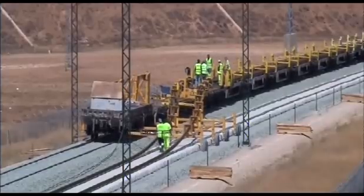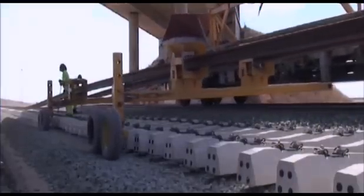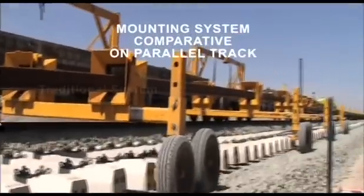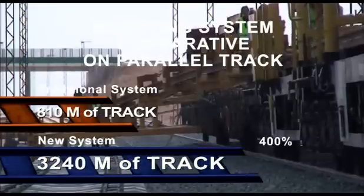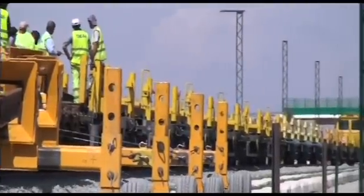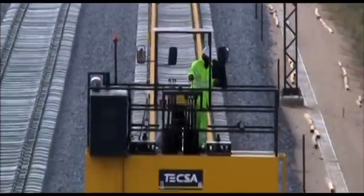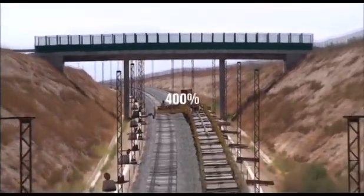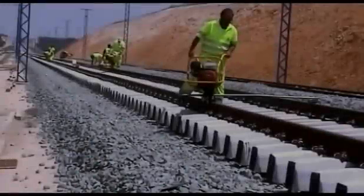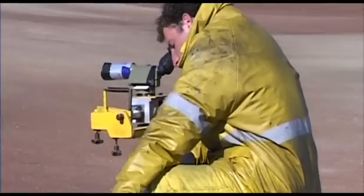With the TEXA system of lateral unloading of track on the sleepers using the parallel track, a progress of 12 long welded bars — 3,240 metres long — is achieved. As can be observed, the TEXA system, apart from eliminating the mounting of an auxiliary track, doubles the efficiency of the traditional system on the leading track by 266%, while on the parallel track it reaches 400%. In addition, it allows an earlier start, making the production deadlines of any type of mounting much shorter.